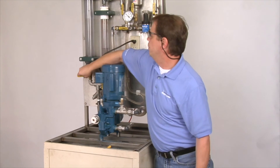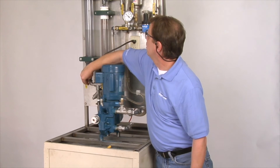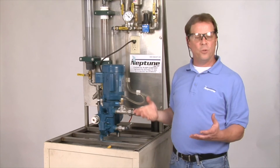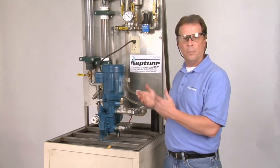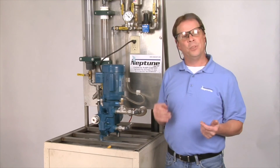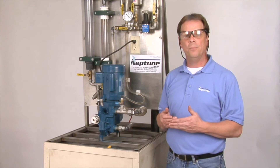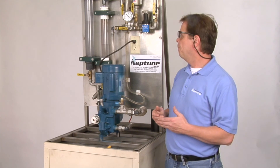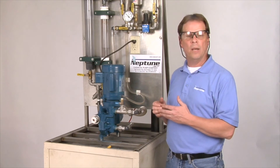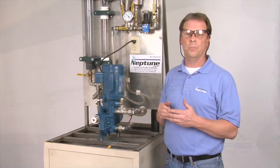I'm going to put a little more fluid in and just let it pump. This is a draw-down tube — you can do a test on it to make sure the pump is pumping at full flow. I like to let the pump run at 100% for about 15 to 20 minutes to make sure everything is good to go. And that's basically how you would start up a 500 series, 600 series, 6000 series, and 560 series pump.